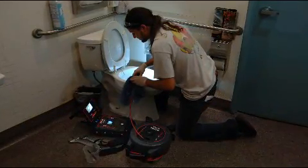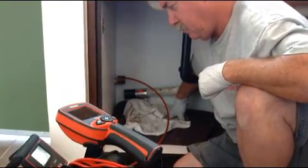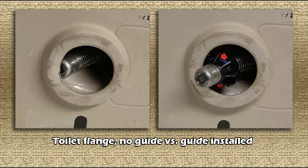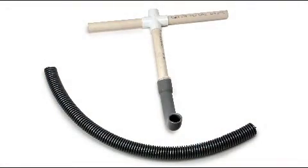In many cases, the Microdrain can enter through low-flow toilets and can negotiate P-traps in tubs, showers, and floor and laundry drains. When entering through sink lines, you'll need to remove the P-trap in most cases. When entering through a toilet fixture, pipe-centering guides are especially useful and can often mean the difference between making it through easily and not making it through at all. A cable guide can also be helpful when entering through toilets. A cable guide helps protect the fixture from being scratched by the camera and allows you to push the camera from higher up in the bowl. You can make a simple guide from a piece of flexible hose or assemble one from lengths of PVC pipe.